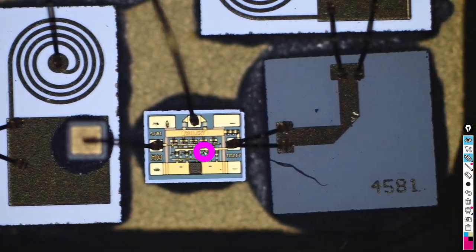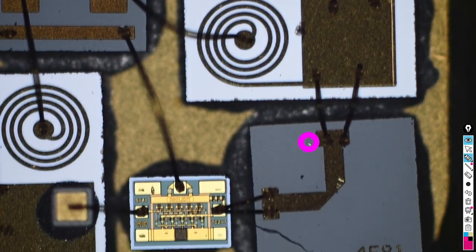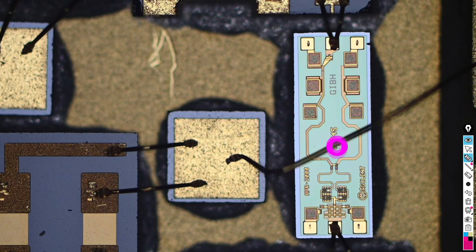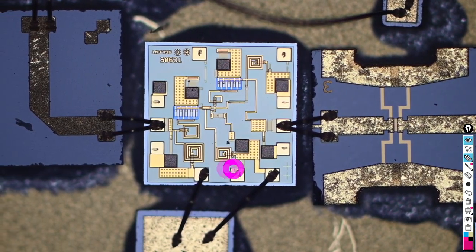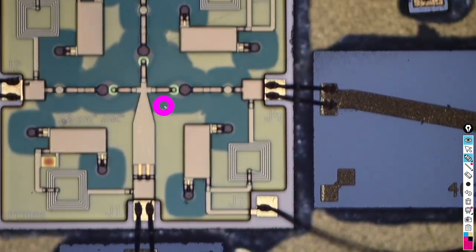This has to be repeated one more time, and you can see it's exactly that — there's yet another amplifier after it with the same kind of bias T. After that, the signal goes out through what is quite capacitive, and then comes through this device — this is our doubler. This doubler is a classic rectifier-based doubler, quite common. This component goes up to 50 GHz. From the output of that, we go into yet another attenuator — looks like another 3 dB attenuator for signal conditioning. And here is our final stage amplifier, and from that we go out to the next element.